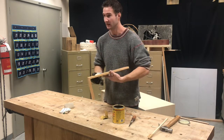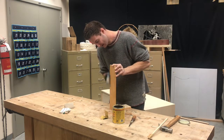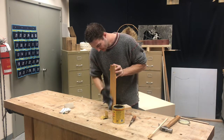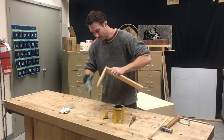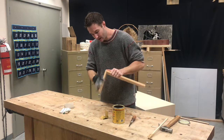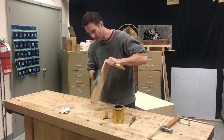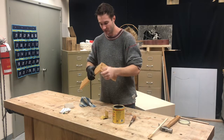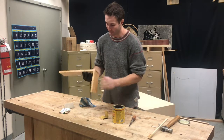Let's say this is about an hour later. Take that rag and buff it out. Even with a thin coat there's still a bit of a sticky layer on top that has to be buffed off - just the excess that's sat on top. There's nothing worse than a stain finish that feels sticky that no one wants to touch. There we go - nice smooth finish, nice golden hue with that natural color, buffed off and doesn't feel sticky.